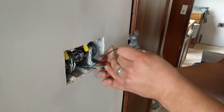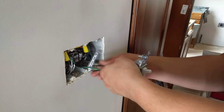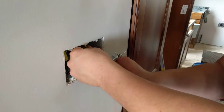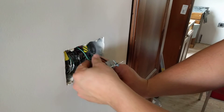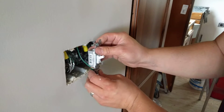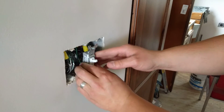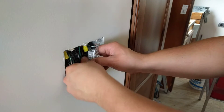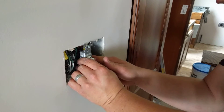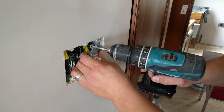Now we're ready to fold the wires in. We're going to try to keep the wires as much in the center as possible so that the box is more orderly. I'm going to fold them all the way up to the back and then do a second fold. You want to be able to get this pushed all the way into position without using the screws, because you don't want to use the screws to tighten the switch into position — you could short something. You want to be able to hold it there and make sure everything looks good inside the box before you proceed with attaching the switch.